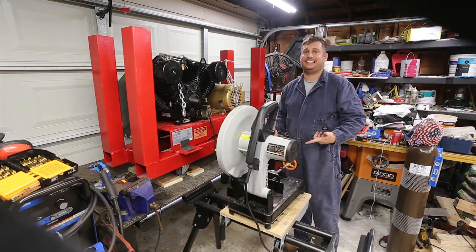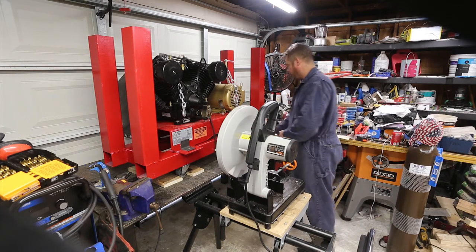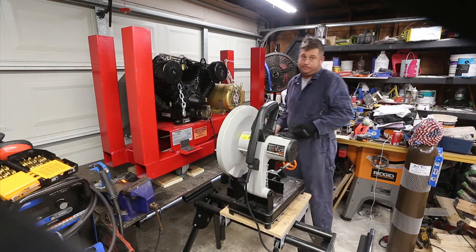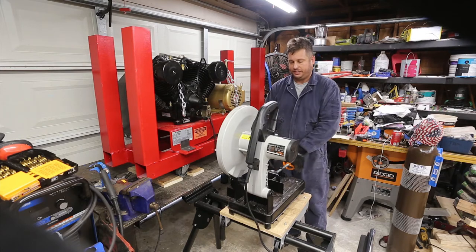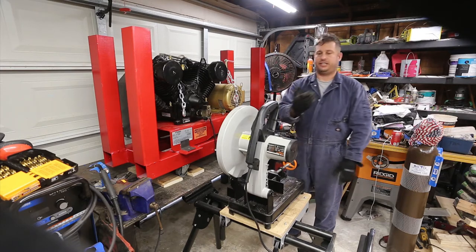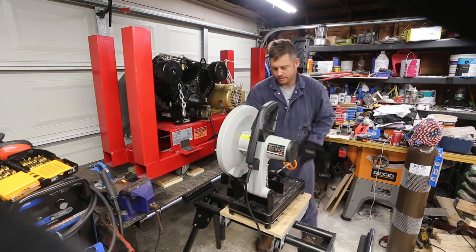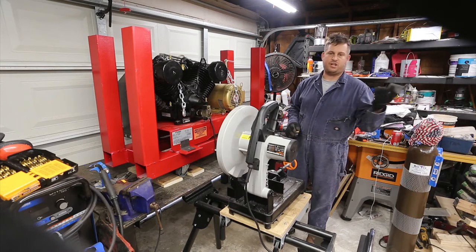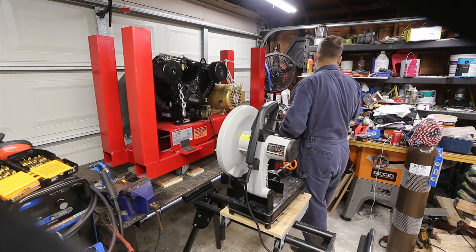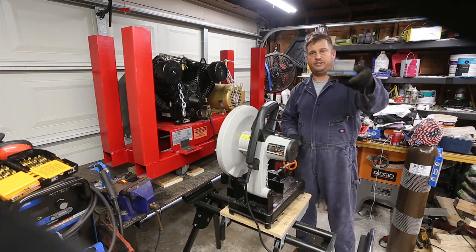That's just one of the many things that having a Rage Evolution saw can do — it makes it really easy to fix fit-up issues that would otherwise require dragging out the plasma cutter and trying to hack a straight line. I've got this nice little chunk that came off a little bit toasty. See if it fits the way I like it to — it does, awesome. Losing that isn't going to affect what this is for. What this does is provide a mounting point for the compressor to sit on a vibration isolator.